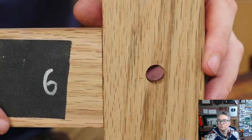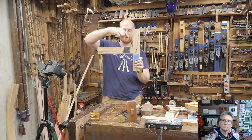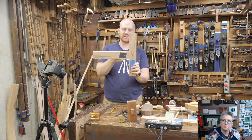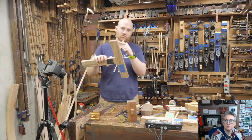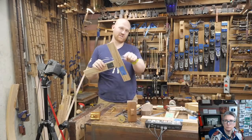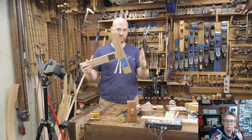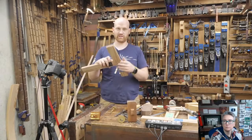You can see it looks really closely lined up except there's a little more on one side and on the other side it dips back in. When I drive that dowel in, it's actually going to pull this board in because the hole in the tenon is moved over toward the shoulder just a little bit. It'll try to make those holes line up, which will suck the shoulder really tight against that joint. The pin holds it in place — it's being pinched because the joint is out of alignment.